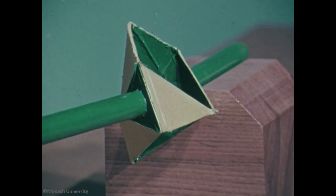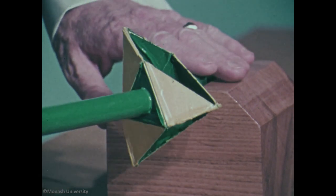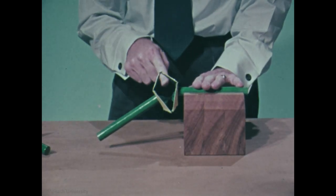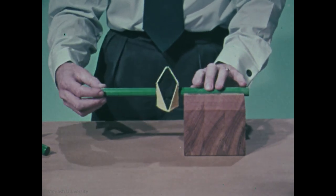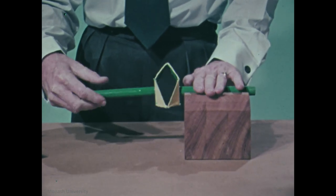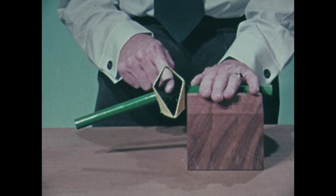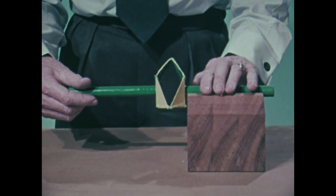And here is one. The tripod legs are slightly crooked triangles, but the shafts always intersect at the geometrical center of the coupling in the plane of the three tips of the triangles. The coupling can plunge or telescope in and out, and this may be a useful property. However, if you don't want plunging, you can put a ball cup joint at the geometrical center or impose some other positional constraint and so eliminate the plunging.